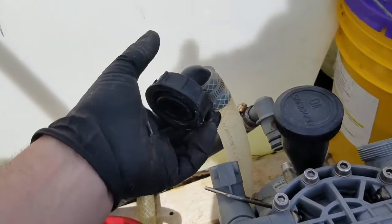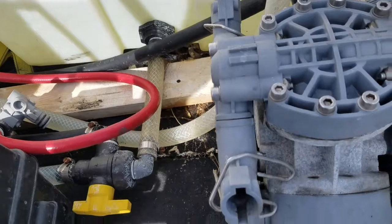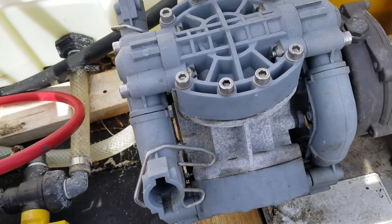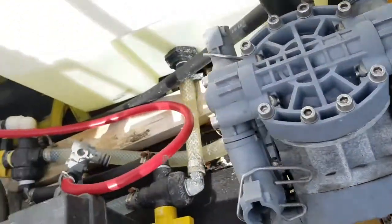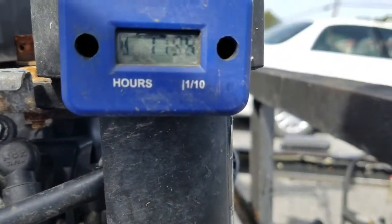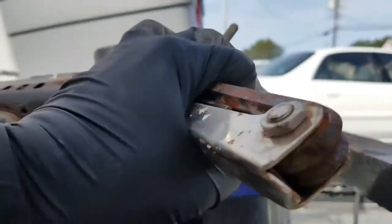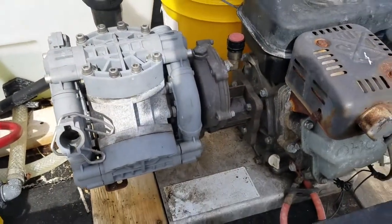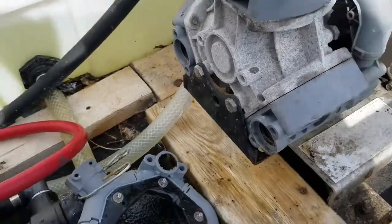I took off the inlet. With this parts order, I'm probably going to order another one of these — basically one of each of the inlets as well as the unloader — so I've got pieces for any future field troubleshooting. You need backups, because if you ain't got backups you're screwing yourself. I'll probably also do an oil change; this machine has about 170-175 hours on it. I love it for soft washing and roof washing — it just speeds up everything and the spray distance is awesome.